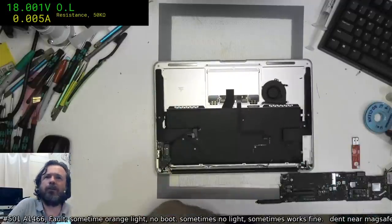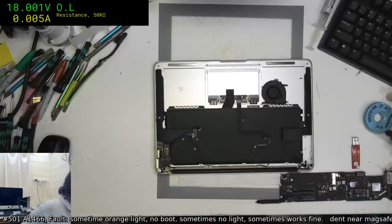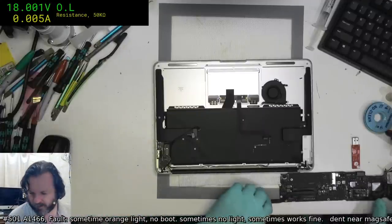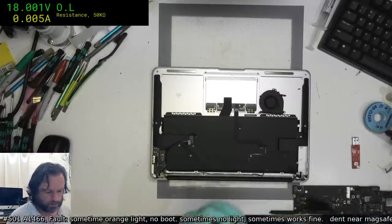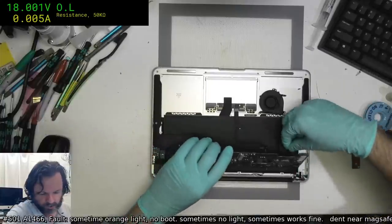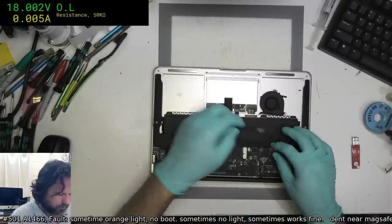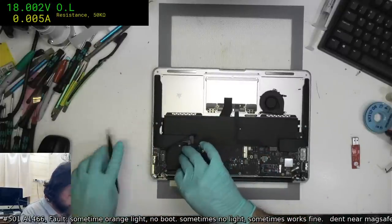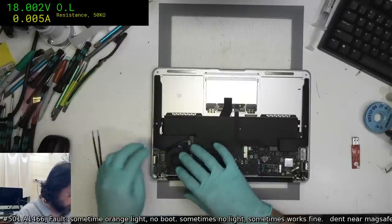What's this? What's Northridge do? Paper towel, cut down paintbrush with IPA. Oh, yeah, I do often use that. I haven't got a cut down one, but I've got the toothbrush. The only reason I didn't bother doing that then is because I sometimes just want to use the hot flux. It gets dabbed up by the paper towel well enough. You'll see in my other videos that I frequently do the wash down with the brush and alcohol onto paper towel. Just didn't do it this time. Sometimes your mood just says, nah, I don't feel like doing that tonight.